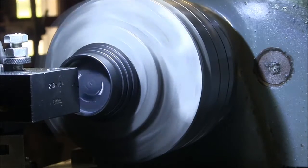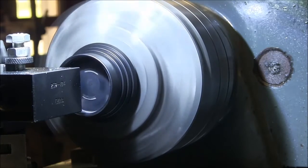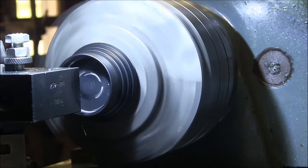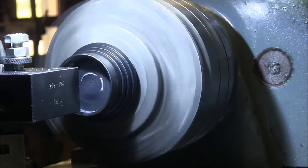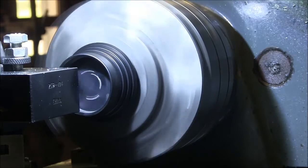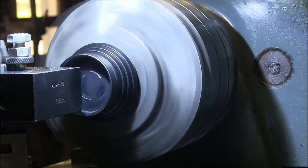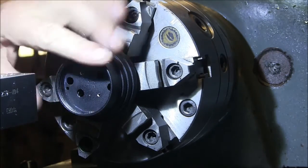Just want to make this round so that the heat sink goes in. We're not going to use these threads or anything. I only have this thing gripped on the ID loosely because I don't want to bend it out of round, so I'm taking light cuts here. Okay. Now this thing is round and we can fit a heat sink in there